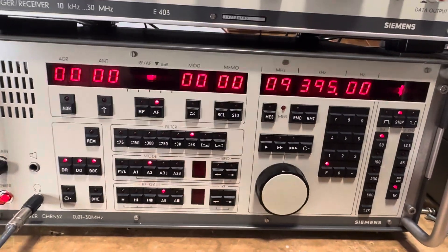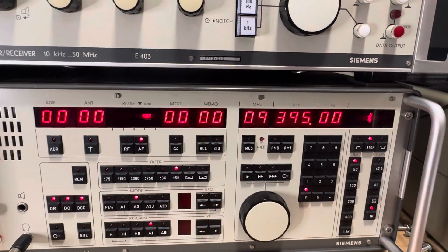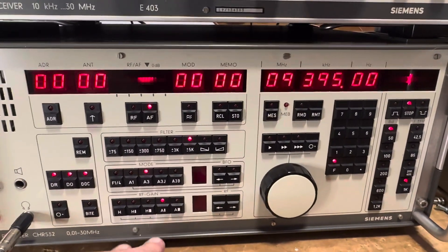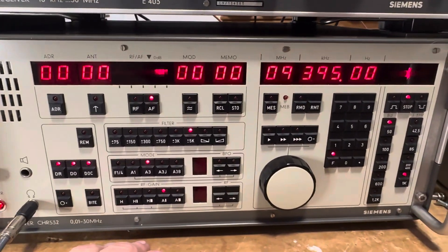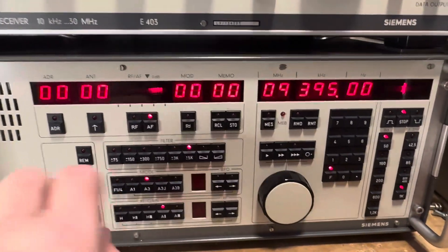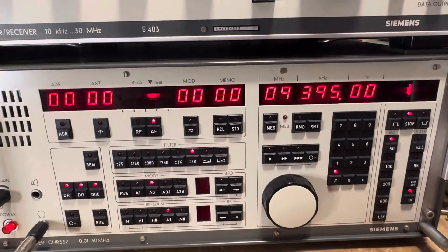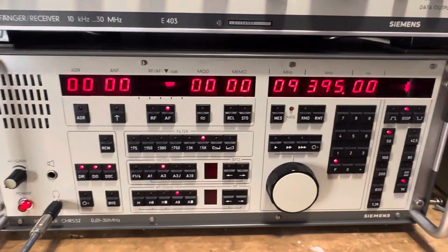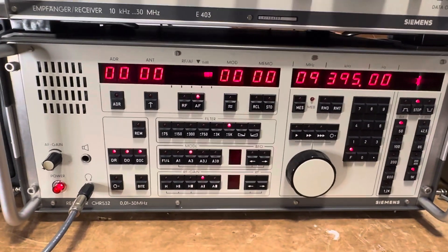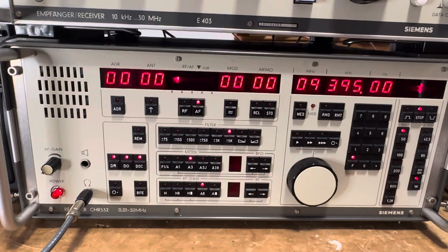Some interesting things about this radio: as I say, it has 100 memories built in and dual antenna selections. The AGC has five positions — normally you'd get three, so five is quite a lot. You can tune the manual AGC through the RF gain. The RF gain is all buttons here instead of pots like you normally see. The documentation I have is for the 531, which is basically the same machine inside except for the front panel.